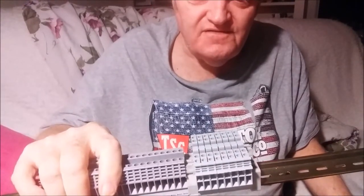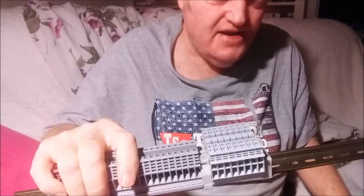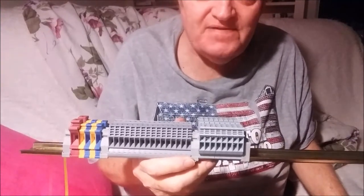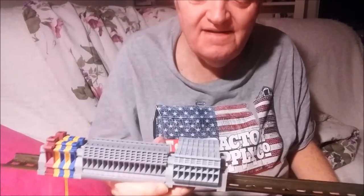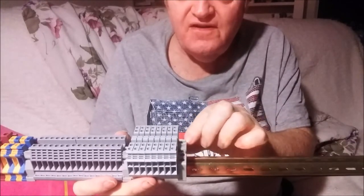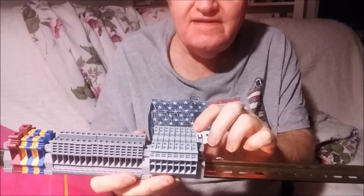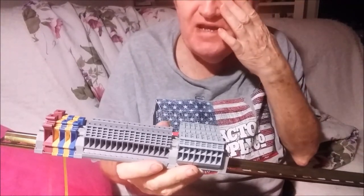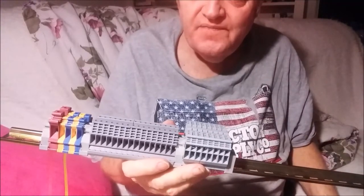Here's another kind of odd block — this is what I was looking for when I found Clarice. She sells all this other stuff — power tools — from a huge warehouse. What this is is a terminal block that's got two ins and two outs — four wires, all connected together. The bar runs underneath and connects all four. I only need three for this application and for the battery management system circuit boards.